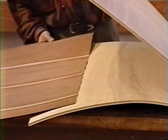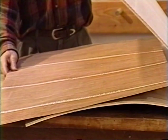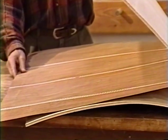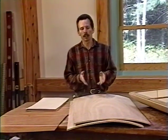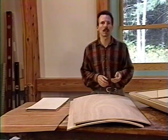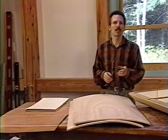This time I'm using 2 layers of a 3/8 bending ply with a single sheet of backer grade veneer between them, with the grain going 90 degrees to the bending ply. I always try to run each layer perpendicular to the next whenever I can, especially with this 3/8 material. It's rather coarse. I'm going to glue the final face and backside veneer later in a second operation. I'll explain why at that time.